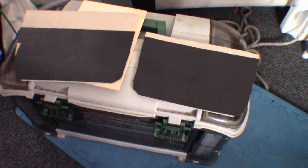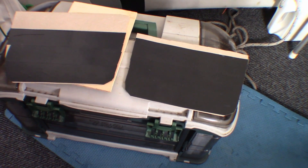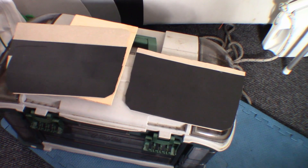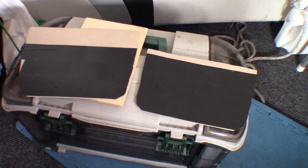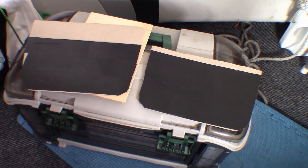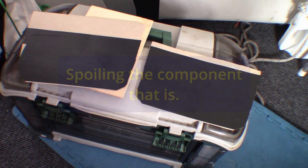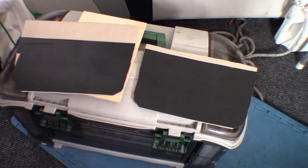I've got a couple of bits of cardboard here that I've lined with duct tape, and the idea is to create a dam to hold the moulding compound in while it sets, without going to a lot of trouble trying to make a wooden dam. The cardboard cut-out is going to be easier, and I'm hoping that the masking tape will stop the mould material from penetrating into the cardboard and spoiling it. If it gets into the sides it shouldn't be too much of a drama, but the key bit is that the floor is shaped correctly.